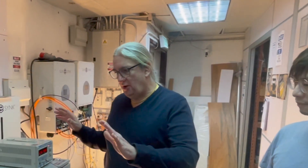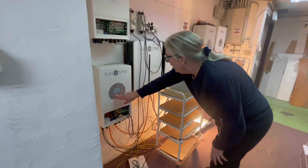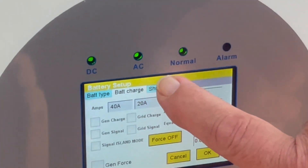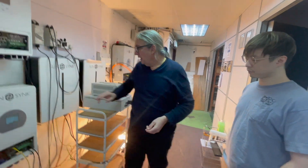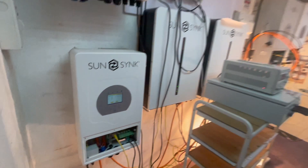A lot of this is to do with the UK — we're introducing a special low power mode. This setup is purely to test the thing works and prove it actually does. If you go into battery settings and then battery shutdown, you'll see 'low battery mode' and 'low power mode'. Low power mode is particularly used for countries with no sunshine in winter, i.e. the UK. The low battery figure becomes the level at which low power mode operates.